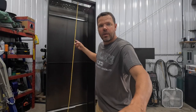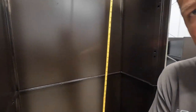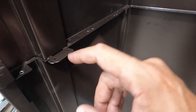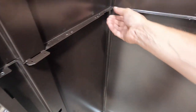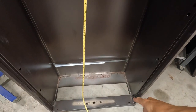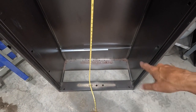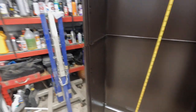So you stack these up — it's about eight feet tall. I'm going to fix them together using these screw holes; I've bent these flaps down, put screws through there, and that should hold it. We can tack weld it if necessary, or just put more screws through. I'm going to cut out this bottom piece here and take out those pieces there.